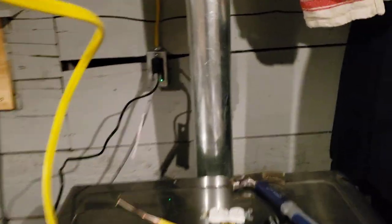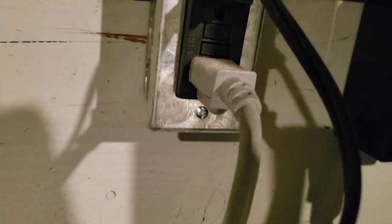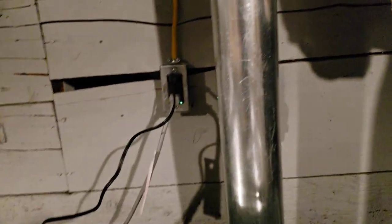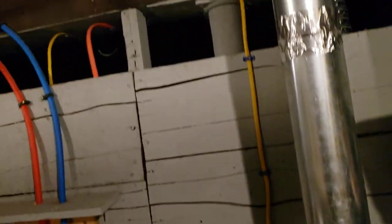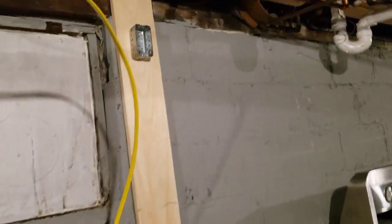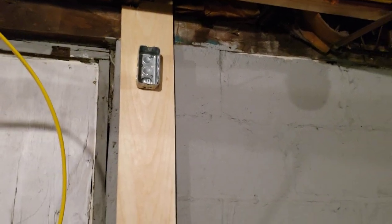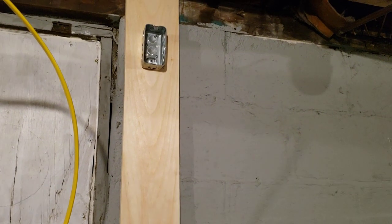Right now I still have one circuit, but I replaced it with a proper 20-amp GFCI receptacle. I'm in the process of splicing that out and running it to new regular outlets that'll be protected by the GFCI. Those are going to run over here — I've got one box installed on this side.